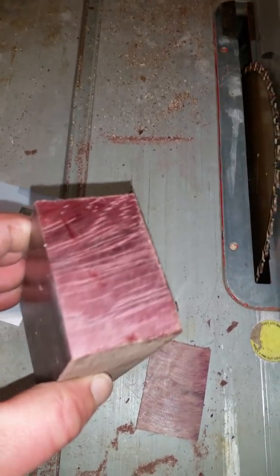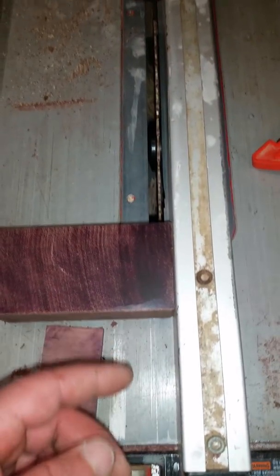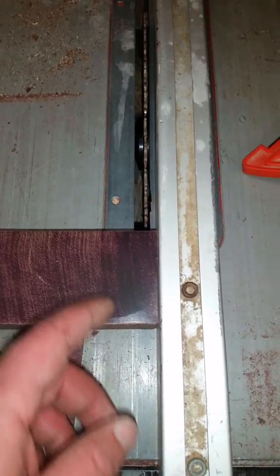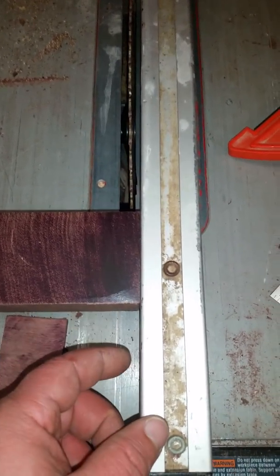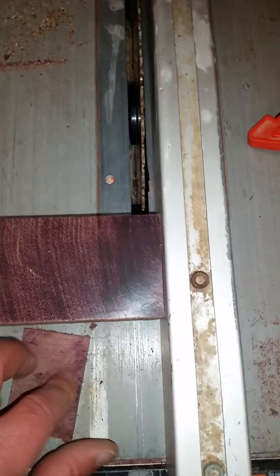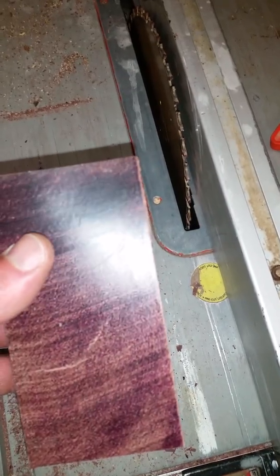What I'm going to do is make as many of them as I can. Basically, I'm going to devote this whole block to it and just cut them. I'm sure there's some sort of slide jig I can use to set the depth. I was thinking of clamping something here and using a sled dog, making it twice the width, say 1/2 inch, have a 1/4 inch offset here. But I'm just going to do it the hard, stupid way and just slide it in and cut it. So that was a long explanation for just about nothing. But yeah, setting the width is critical.